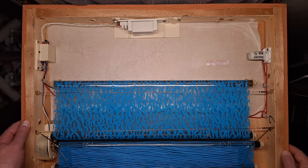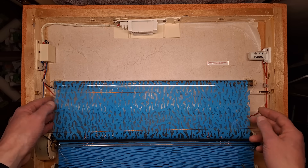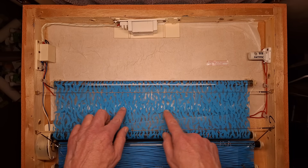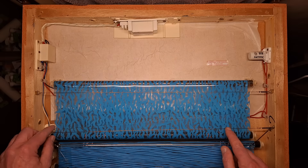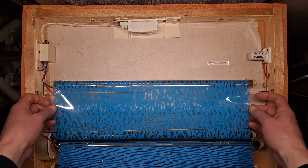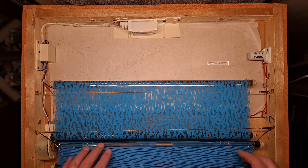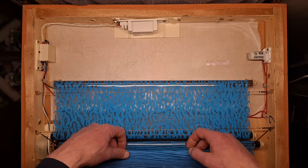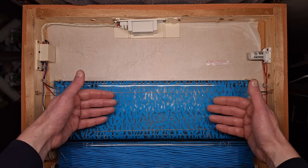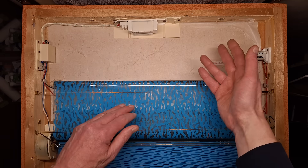Okay, this is better. I'm standing on a seat now with the camera up a lot higher. So what we have inside behind here: we've got a fluorescent tube and this is a little conveyor belt. It's got the ripple pattern of the falling water on it, but there are two layers effectively — one layer at one side, one at the other. There are also little wires stretched across like springs. The bottom bit is also a conveyor but has a fixed layer that doesn't move, plus a moving layer behind it, and there's a metal reflector at the bottom that catches the light coming out sideways from the fluorescent tube and projects it upward.